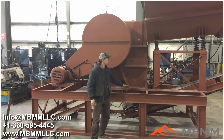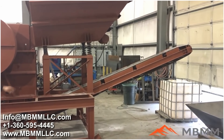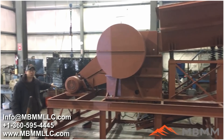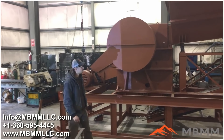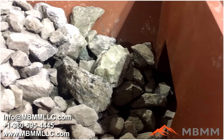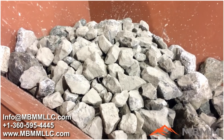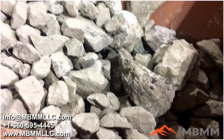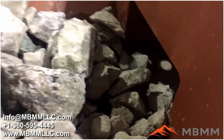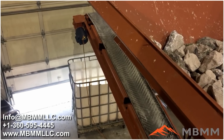The material falls down through the Jaw Crusher and onto our conveyor belt, which discharges into a pile — right now we're going to catch it in a tote over by the doors. The hopper is run by a three-phase, three-horsepower electric motor. The Jaw Crusher is run by a 40-horsepower three-phase motor and the conveyor belt is three-phase as well, so it can all be run off a generator or off three-phase power if you have it at your shop. The rocks will work their way down into the jaw mouth and be crushed down to about one inch minus.